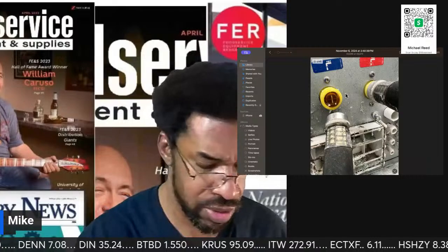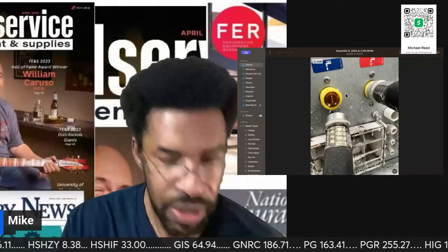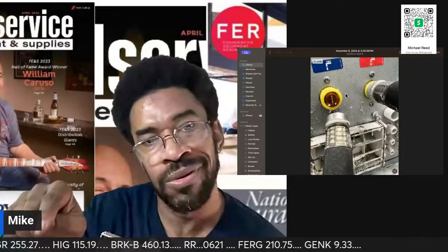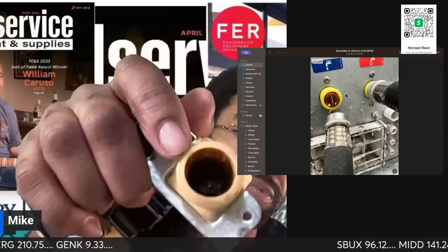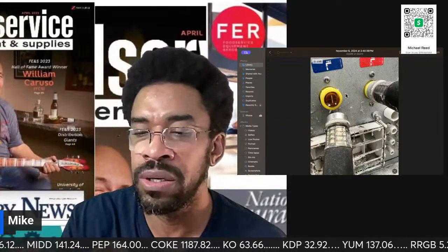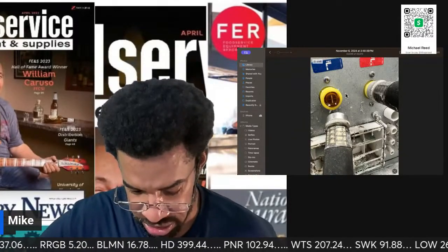So the water here is really acidic. This is from a hotel. Once again, this is cradle to grave. I didn't put these laundry system units in, not this one. But the owner and the builder are one and the same. So for years I have been telling them that their plumbing is jacked up. And they said, no, the plumbing's fine, because I keep having to do work on the dishwashers. I keep having to do work on everything associated with the water. And right now, I need to tackle the ice machine. They have a Manitowoc in there, and it is just vomiting scale.